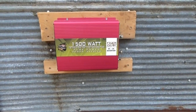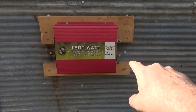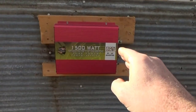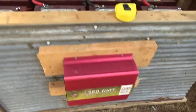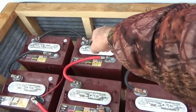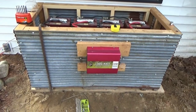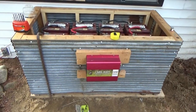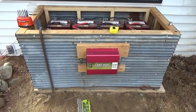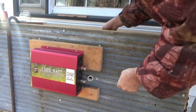I'm going to be connecting this up. Right now I'm going to use my TacLife rotary tool to cut a hole and put a conduit through to run the battery wires and then the AC wire into the battery box. The battery wires are connected to the batteries, and the AC wires will run through the conduit into the house, and into a power box I'm going to build. I'm calling it a solar generator because it is going to be a separate unit, not wired into the house.